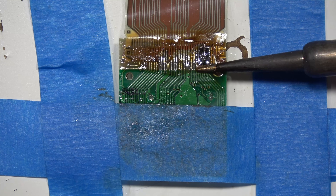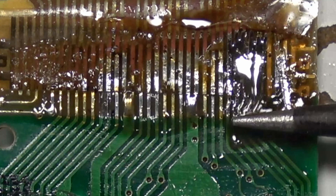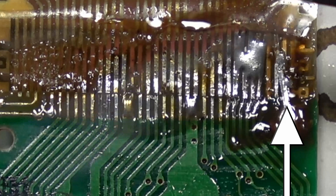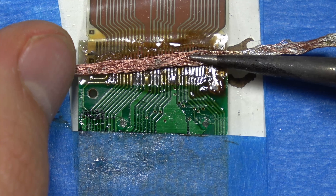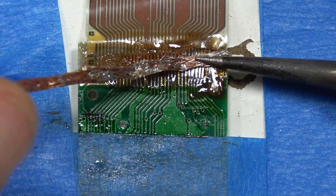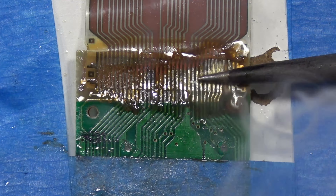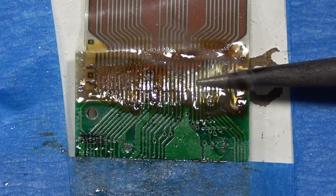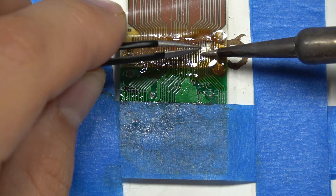If you watch this one and then go back to the first one, you'll see exactly what not to do. Note there's a trace all the way to the right that got yanked off — those traces don't do anything so it doesn't matter. Because I couldn't flow the solder down, I'm using solder wick to remove it. With wick, you put it right on top of the solder you want to remove, heat up the wick — it has flux in it which absorbs and sucks in the solder — then lift it up and it's gone. That removed the majority, so I'm trying to just flow it down again. After flowing didn't work and wick didn't fully work either, I need another approach.